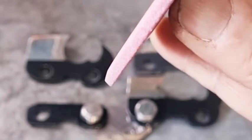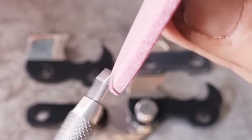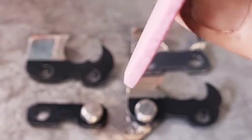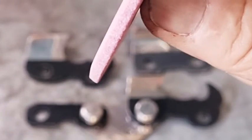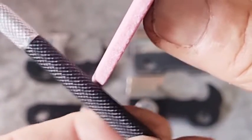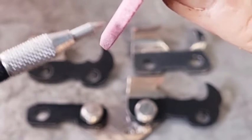and at 45 degrees. So on an Oregon grinder, this wheel's off an Oregon type grinder, you want to be setting that at 45 degrees, because this is 15 degrees here. So that's going to make 45 and 15 make you 60, plus you've got it tilted at 45, and this angle here, the 15 degrees here, will make it 60 degrees there. So there's your 120 degree hexa. And I've tried this wheel out before, and it really does work well.